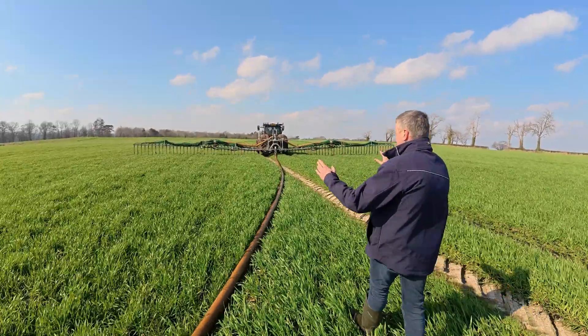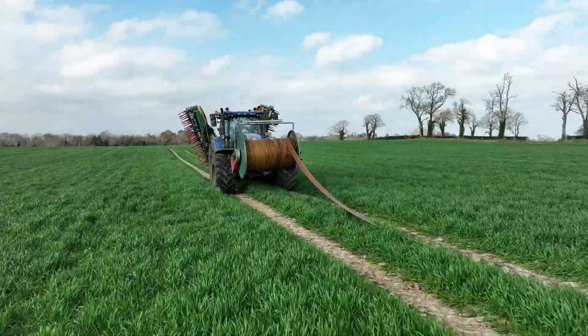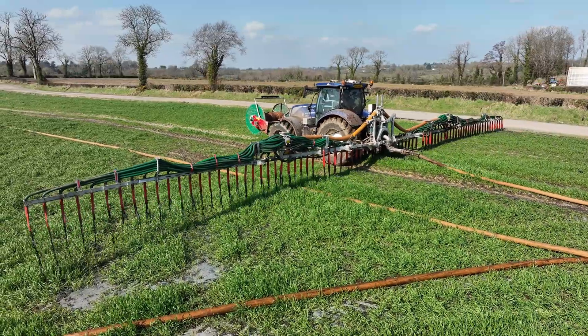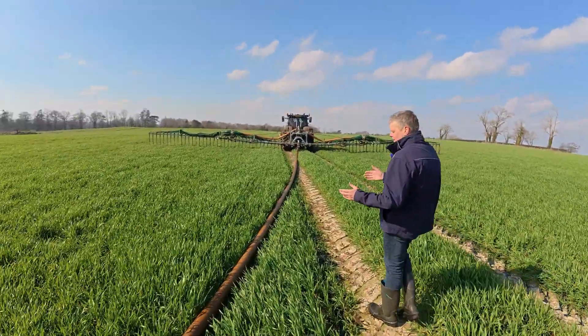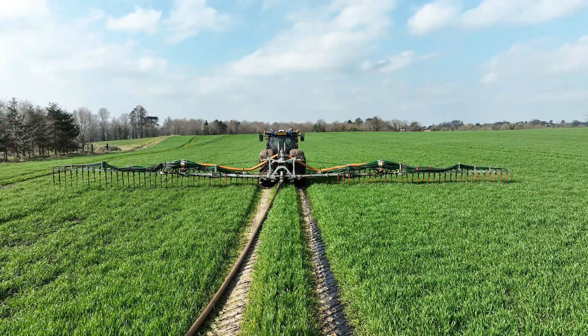This is a second application. Looking at the machine, we're dragging four-inch Auriflex hose today, not five-inch. The machine will work at very high flow rates, but what we've proved — another major advance we've made technically — is that right down to 90 cubic meters, feeding with four-inch hose, we're still getting perfect distribution right across the whole width of the machine.